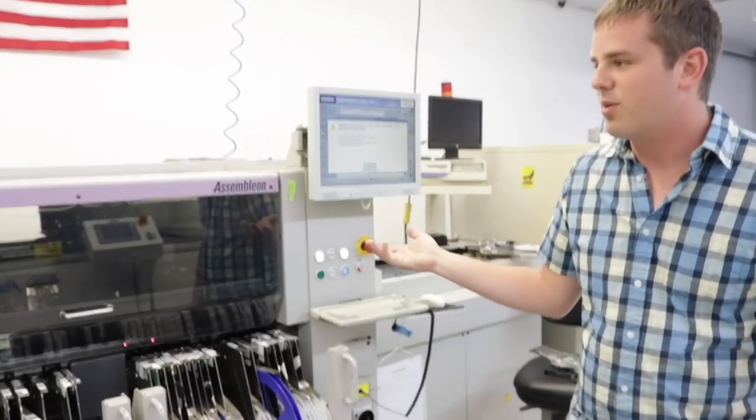What did you have for your kit right out of the gate? When I officially started, we did all prototype assembly by hand — hand printing circuit boards, hand placement, then running through a little Chinese reflow batch oven. Early on we were sending our product overseas for manufacturing. We had lots of lead time and quality issues, boards would come back needing rework, and at some point I just said I'm done with this. So we started with a little desktop pick and place machine, then got a Manncorp — a bigger faster machine — then eventually got a pass-through conveyor, solder printers, and all that. Now we're running 24,000 chips an hour on the assembly line.